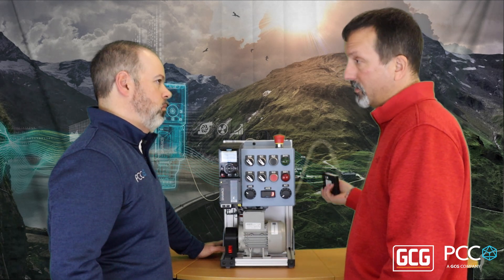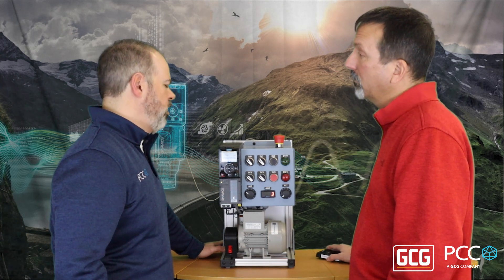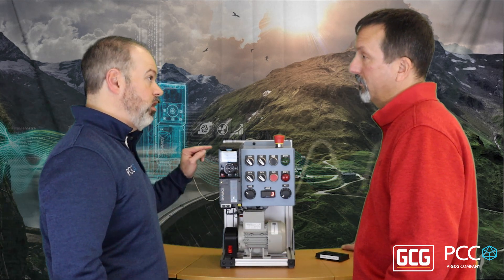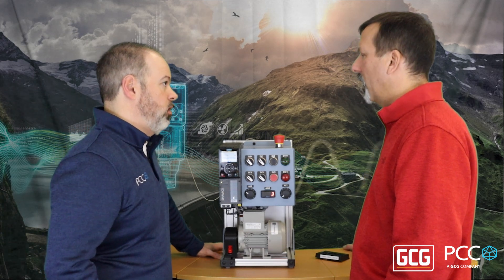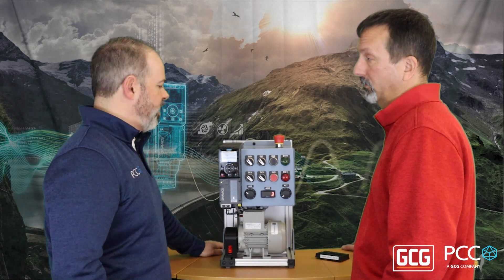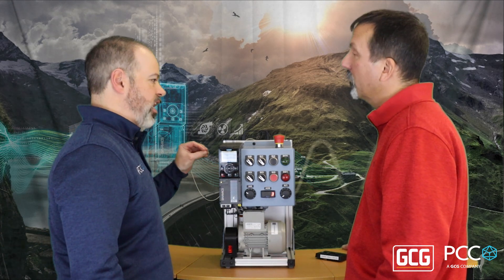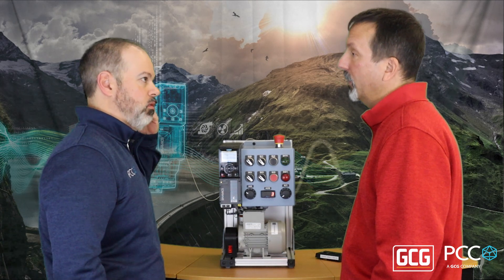And there are macros directed right towards pumps and fan markets. The interface on this smart access module for the free function blocks is actually really nice. So free function blocks — are we talking about putting logic into the drive, if-this-then-that type of thing? Not quite. It's ANDs and OR gates, some timer functions — Boolean logic. So if it gets a shutdown command but I want it to go for 20 seconds after, I can have that timing delay built into the drive as opposed to some external control device. Yep.